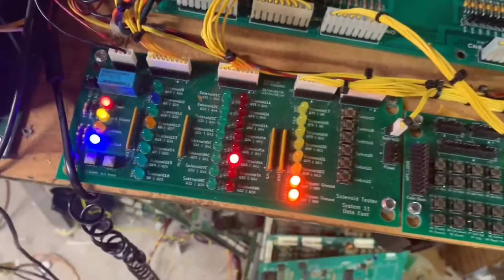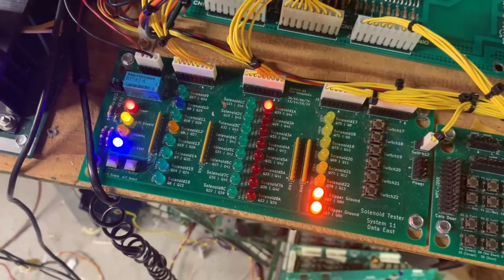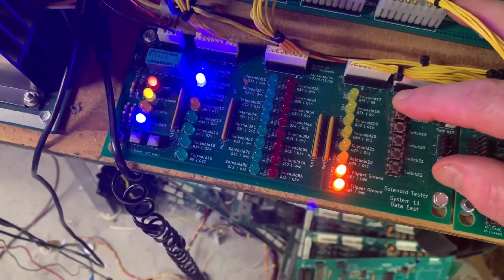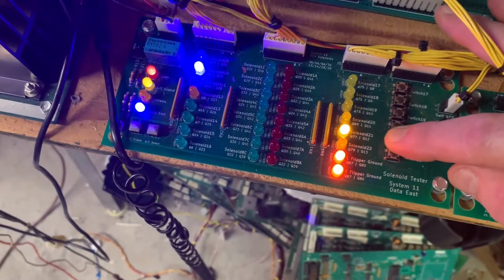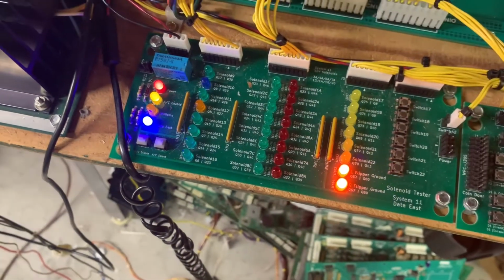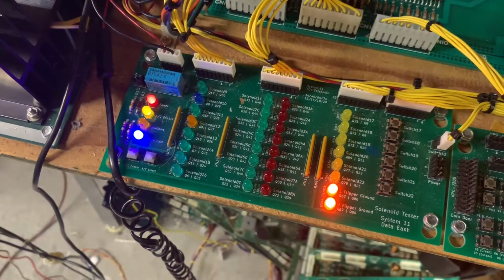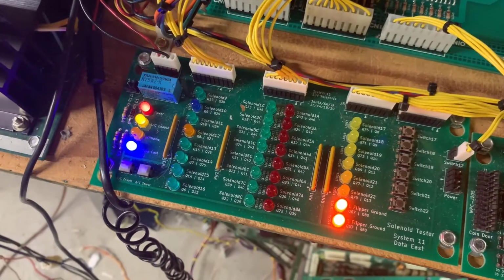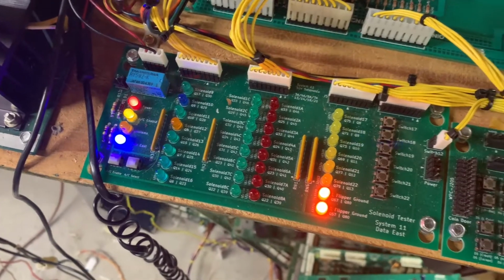Flashers, and now these solenoids. Now while it's going through those first several multiplex solenoids, let me show you how the switch input solenoids fire. So all 6 of those are working properly. That was 8A, 8C, and then 9. It skips 10 because that is the AC select relay. It's already proven that it works.